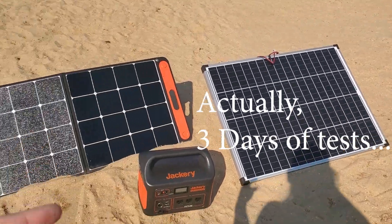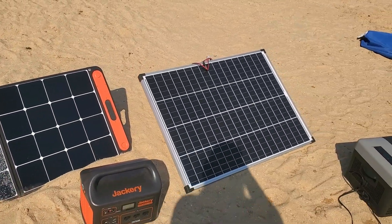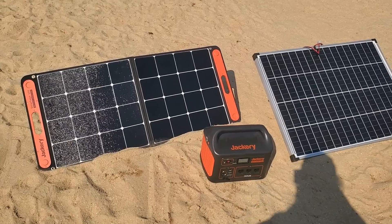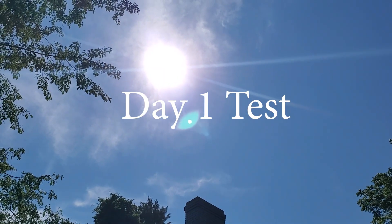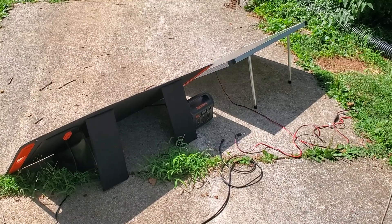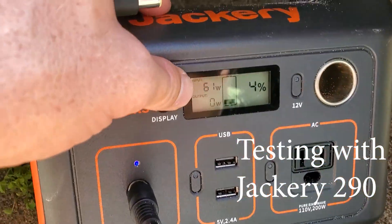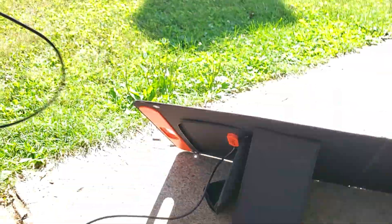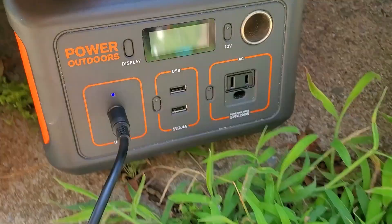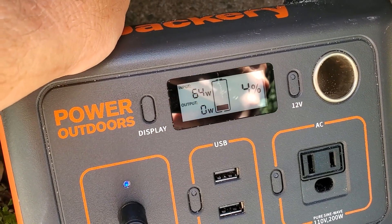So there are three different options at three different price points — all will do the same thing in the end. I did a test yesterday with these Jackery Solar Saga 100-watt panels and the Harbor Freight 100-watt panel that does not fold, and found some very interesting things. We have good sunshine — basically blue skies with a little haze, plenty of sunlight. It's summertime, about 3:45 PM, sun doesn't go down until 9. The Harbor Freight panel is plugged in — 61 watts.